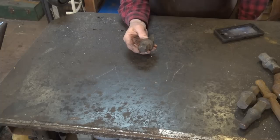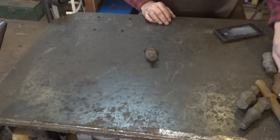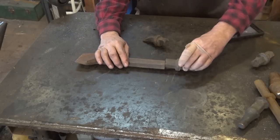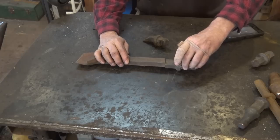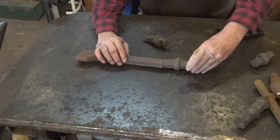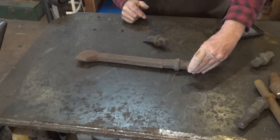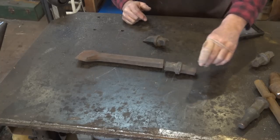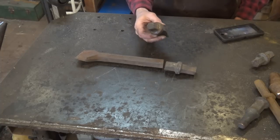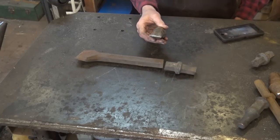What makes this hardy a good way to go is that it's actually a repurposed jackhammer bit. Jackhammer bits have collars — unfortunately I've cut all the collars off of mine, but that collar makes a nice shoulder that's already there and ready to go into your anvil. You just have to square it up to fit the hardy hole, and then the end was forged into the chisel.